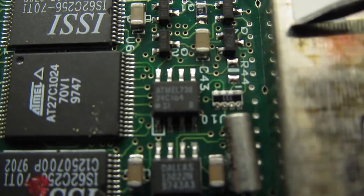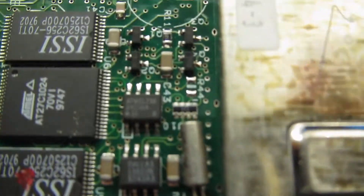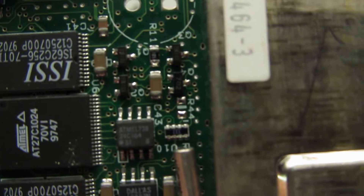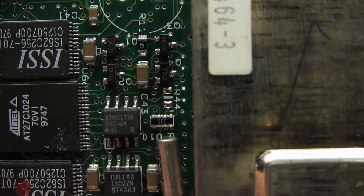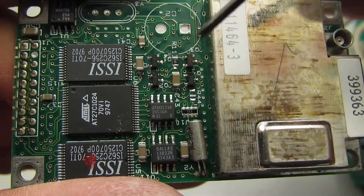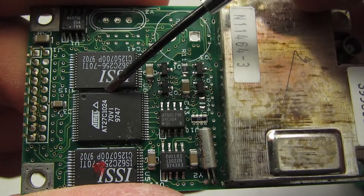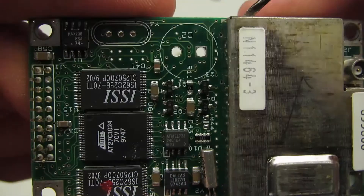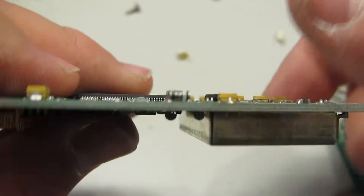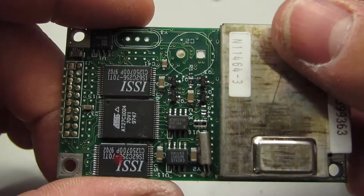So what's this Atmel chip? Okay, that's another EEPROM — a two-wire serial EEPROM. I'd be willing to bet that the bootloader is on this, and then the main software is on that. There's also a place for a gigantic capacitor there — I wonder if they had originally designed this to use a supercap rather than a battery.